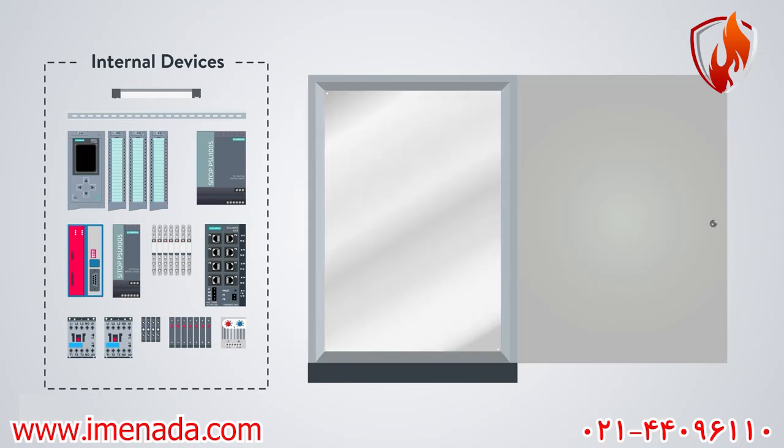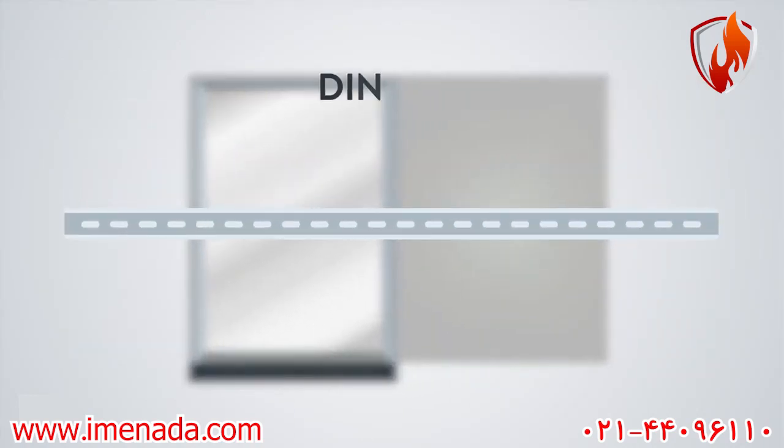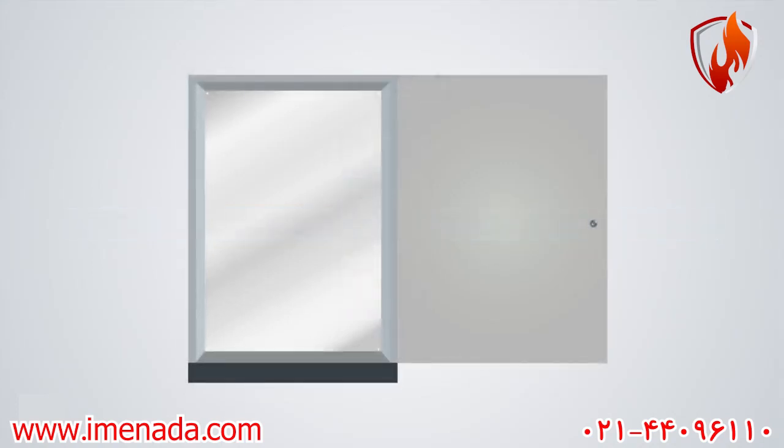The first piece of component to install on the mounting frame is the DIN rail. DIN rails are long metal strips with a standard size and some holes in between that we need for mounting the electrical devices on. In other words, instead of installing each piece of component separately, we can snap and click the components into place easily. So, we cut and install them according to the panel design.